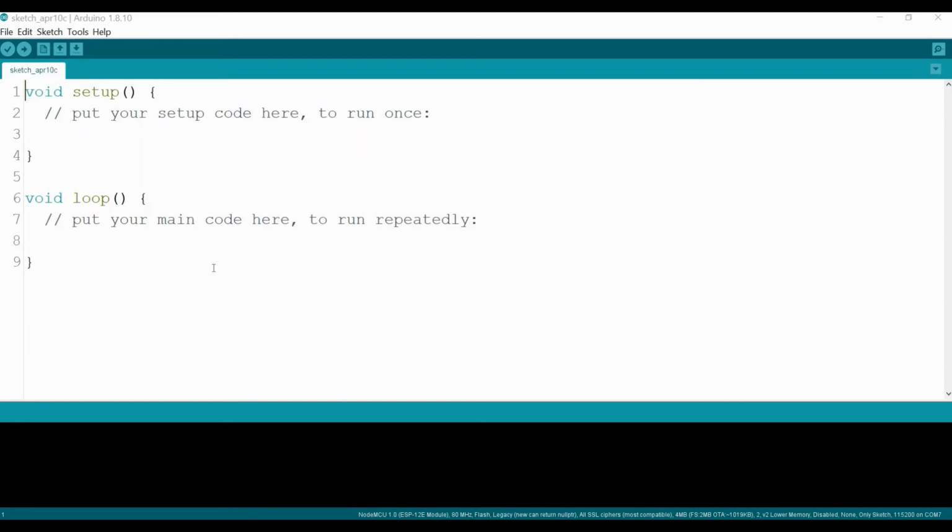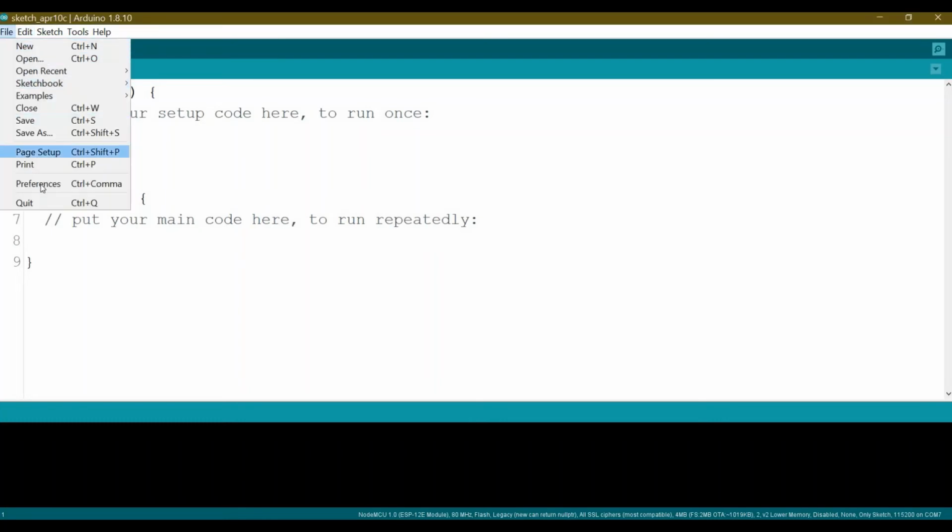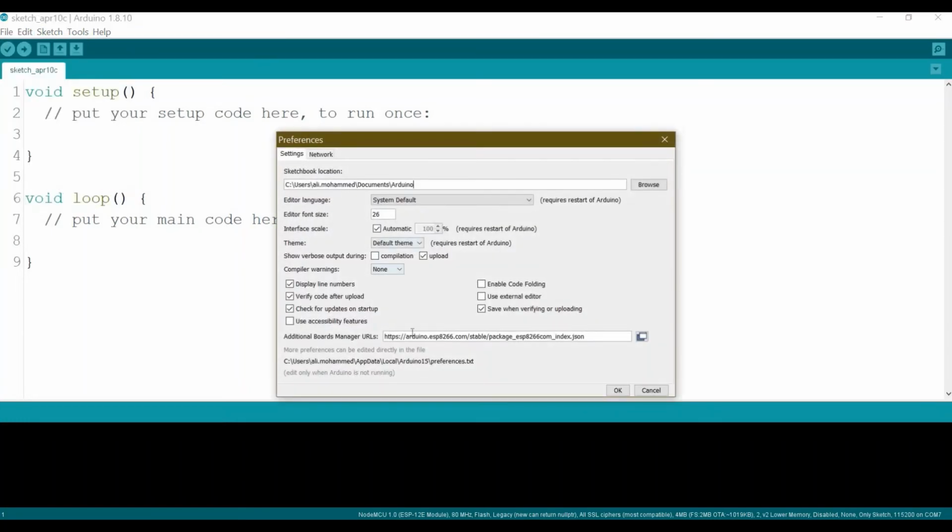Okay, so first of all, the first time you are playing with the ESP8266, we have to go to File, Preferences. Then we have to make sure that we have this link here. I will give you the link in the description down below, so you can just copy and paste it. It's very important, this one, to let us access the ESP community boards that we will download later. Okay, we paste the link here. You will find it below.